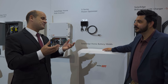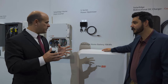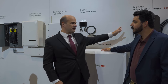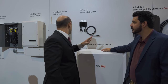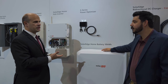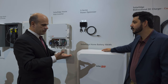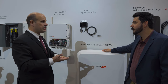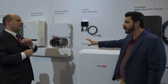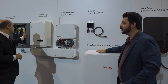That makes someone say maybe they won't get an electric vehicle. With a DC coupled system, avoiding the main panel upgrade is key: the battery doesn't go on the AC load center, the charger doesn't go on the AC load center, and the inverter just takes up one spot in the load center. You can add batteries, add PV, add EV charging — and it only takes up one breaker position. The power control system is integrated within it to throttle things so you don't have to do the electrical upgrade.